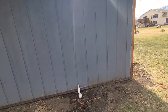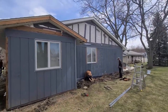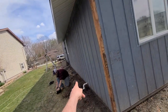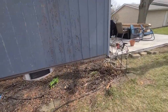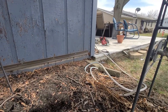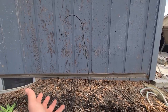We spent way too much time figuring this out so I'm going to backtrack and get you guys caught up. Here's a visual of what the house looks like - this is the back of the house. Over here we have one of our smallest numbers down from that line, about 22, and on this corner our biggest number. You can see where they painted the block foundation and how much we actually cut off that T111. We did a test cut to find out if we'd expose too much of the bottom plate - we weren't, so we cut off what we needed.